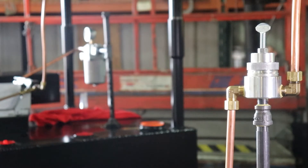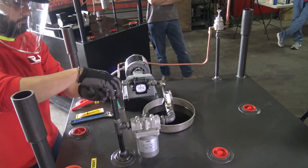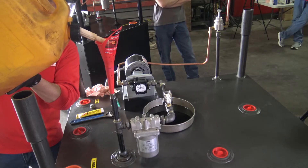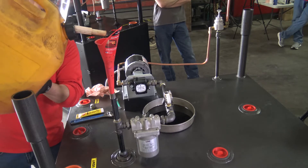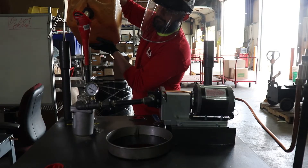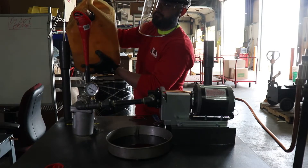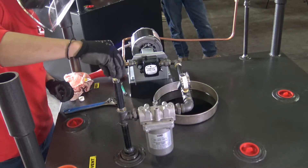Always use an emergency backup heater and maintain fuel temperatures of at least 50 degrees Fahrenheit. Remove the cap from the standpipe of the fuel pickup assembly. Using a funnel, slowly add fuel to the pickup assembly until the fuel level remains above the primary strainer, indicating that the assembly is full of fuel. The foot valve of the pickup assembly will prevent fuel from flowing back into the tank during this process. Use fresh thread sealant and restore the cap to its position on the fuel pickup assembly standpipe.